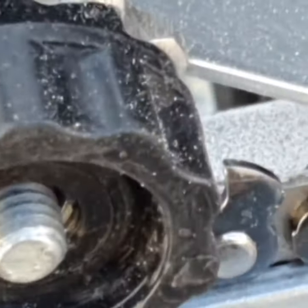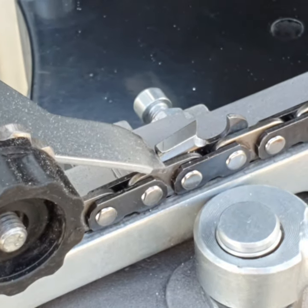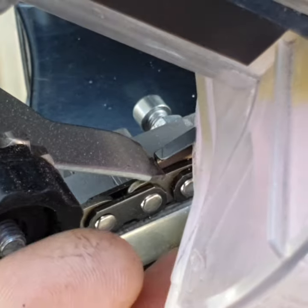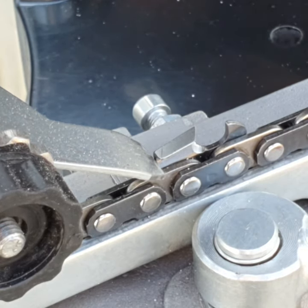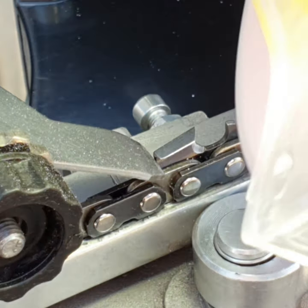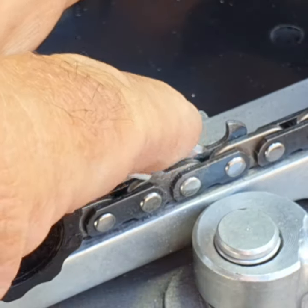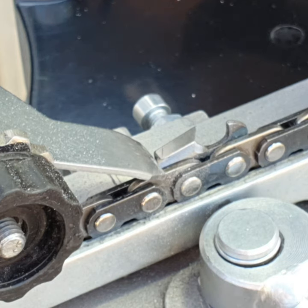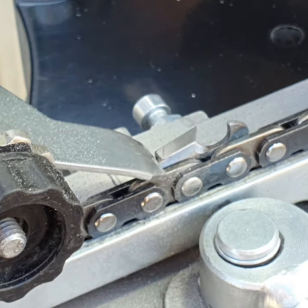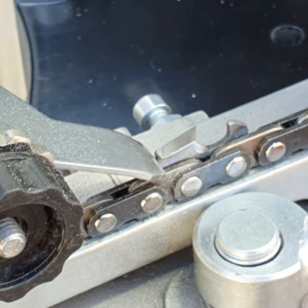Practice will show you the way. We should be ready to grind — just rotate the wheel backwards and forwards and that's ready to go. We turn the grinder on and grind that tooth nice and slow. Beautiful — it's just lightly touched. Possibly have a little bit more, so we'll rotate the knob a little bit and try that again. Beautiful. We'll go to the next one.